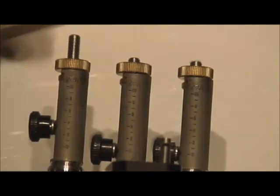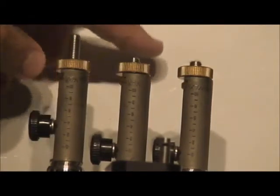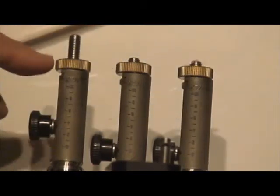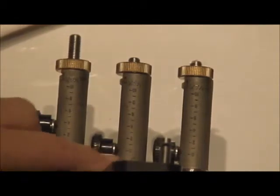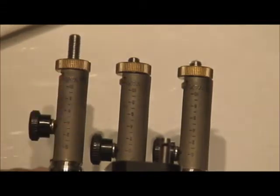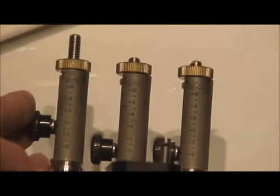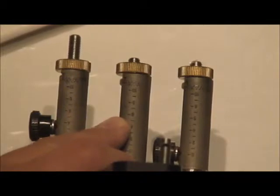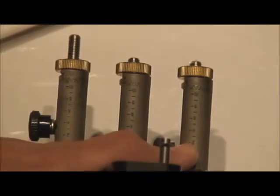This right here is your sodium chloride adjustment directly into your chlorine dioxide mixing chamber, and this right here is your acid adjustment going into the mixing chamber. This knob here should never be set higher than 3, okay? I used to say 2.5. Some of our higher flow rate plants we get up to 3. This one is allowed to go up to 10, and this one's allowed to go up to 10, okay? So that's your adjustment here. This is how you adjust the total and your free chlorine dioxide.